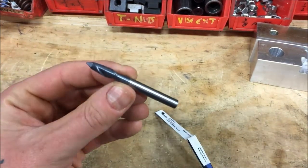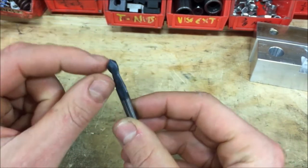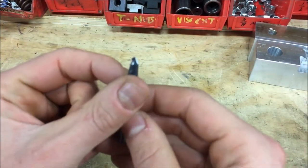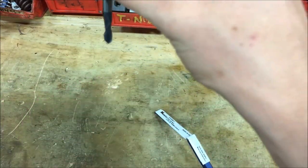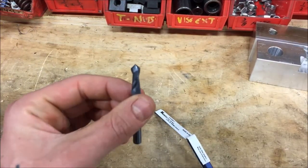So you can see here — there it is. These are essentially a two-flute end mill, just like any other, but you can see the end here: it comes to a 45-degree point. Now the advantage of that 45-degree point is I can run that around the same tool pass that I had at the end of my program and it will chamfer that on a 45 quite well.